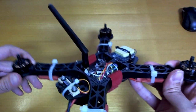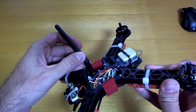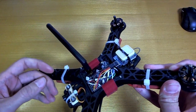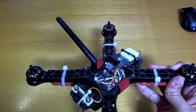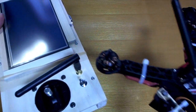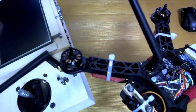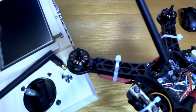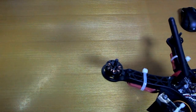I was quite lucky this time in that my radio connection was very, very good. I'm thinking that perhaps the RF24 module in my other transmitter is damaged. The one in this new transmitter I haven't used that much yet, and I'm keeping antennas on them all the time — just in case that was the cause of my problems, since the other transmitter may have been damaged by not having antennas on when it was turned on every now and then.